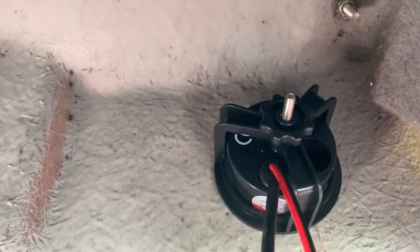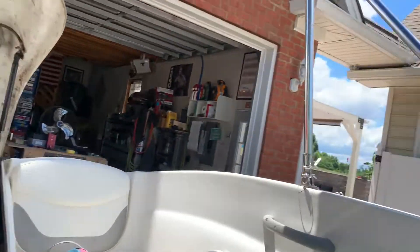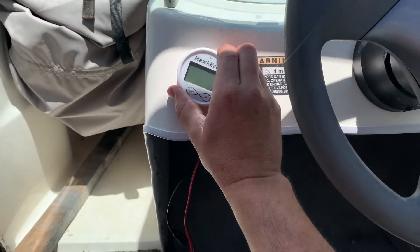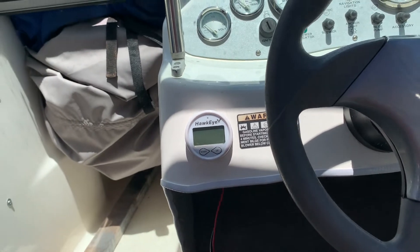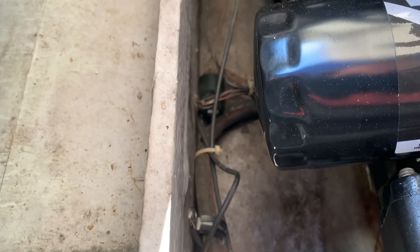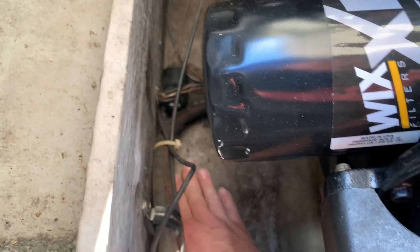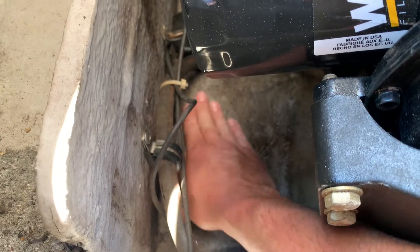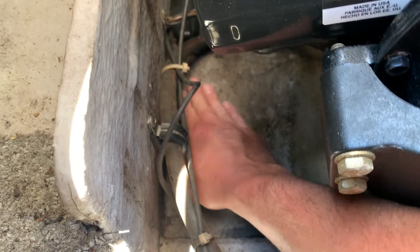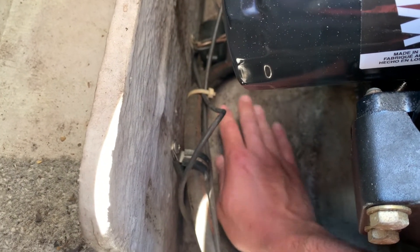It installed really nicely right before the curvature of the fiberglass. With it actually locked into place, that's what she's going to look like — I think it's going to be pretty slick. Now there is a flat spot, which is fairly easy to get to right in front of this hose. That's where I'm going to put the transducer. I'm going to take some sandpaper and get it as flat as I can — about 80 grit or something to knock it down.